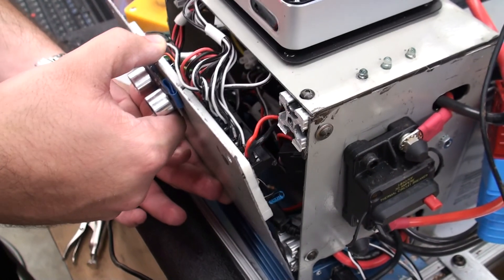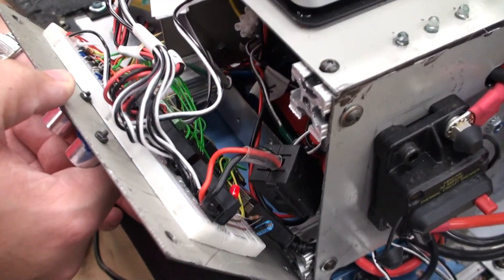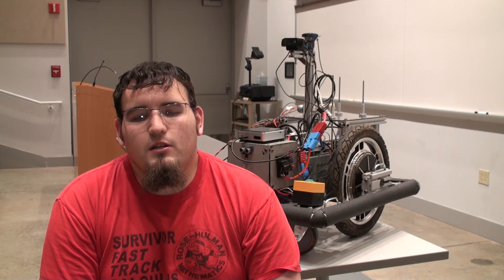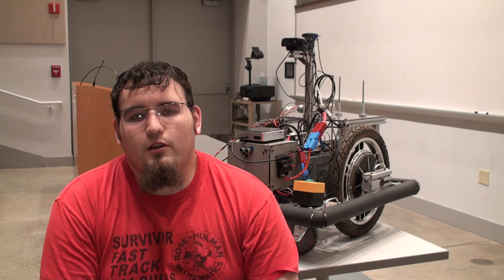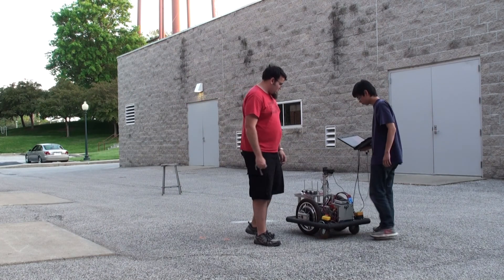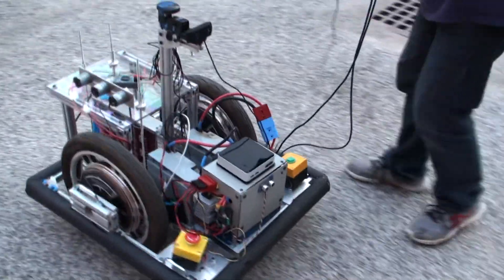The Arduino's primary function is to offload some of the processing from the PC and LabVIEW code. It communicates with LabVIEW via a serial communication port. It handles the firing of the spray cans, as well as various temporary stops — i.e., the bumpers — and the start-stop button for the robot. The bumper system is intended to prevent people or other objects from hitting the robot, or the robot from hitting them.